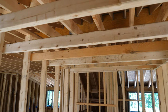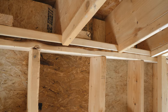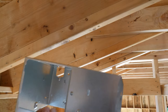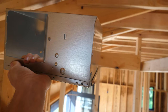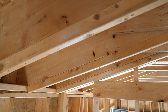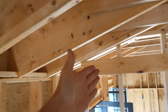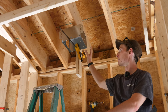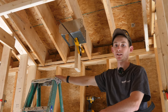That was the easy part getting all those joists on. Now we're into something a little more difficult — the last two-by-six that's got to fit this fan. I've marked the center of the bathroom and mocked this up so the fan doesn't hit that rafter while also being at the right height at the ceiling and centered in the shower. At that location I marked a plumb line on the stud. I'll temporarily screw on a piece of two-by here, clamp the fan box up against it, and that will give us the perfect spacing to put our ceiling joist right there.